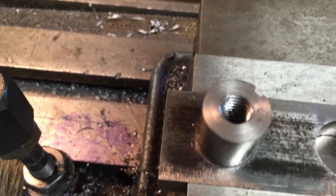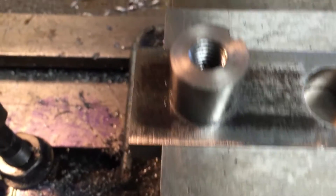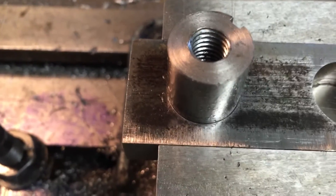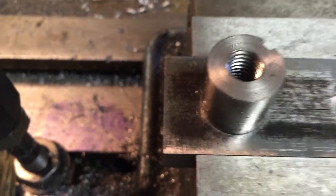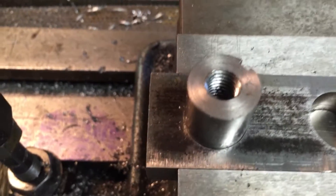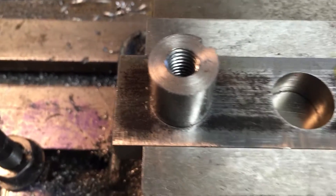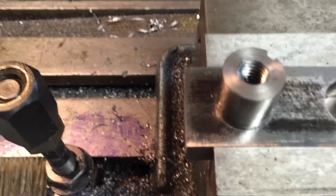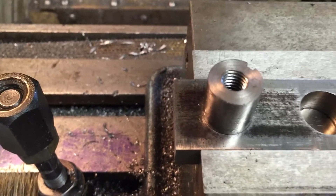Why 45 when it has to be 90? Well, when you flip it — one wheel to the other side — they're all done the same. When you flip that wheel around, it'll be 45 plus 45, therefore the 90. So you only have to set up one jig. And also when you cut the axles, you only have to cut the keyway in the axle once. I put the axle center on the axle and could do both ends vertically — I didn't have to rotate and index the axle. So that's easy, and you know those are in line. And if you're off by a little bit, every wheel's off by the same amount. So really, that's all that matters.